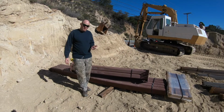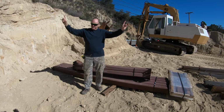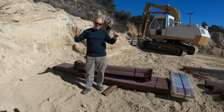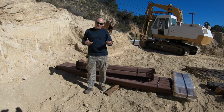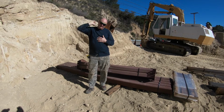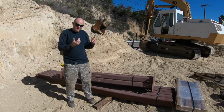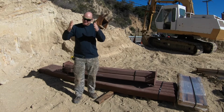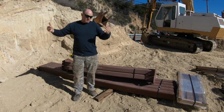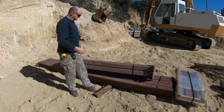Okay, so here we have the horizontal beams that'll be placed about 9 feet up in the air. They bolt between the curved I-beams to hold them all together, and they also act as the support for the second floor. The wooden second floor joists will rest on top of these. These come in two lengths because the distance between the I-beams in the dome section is longer than in the barrel section.